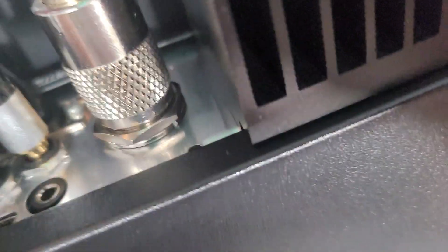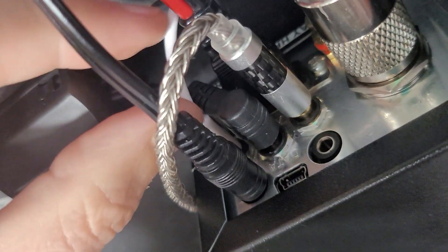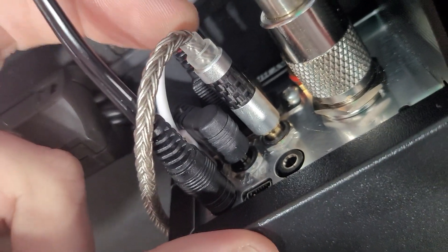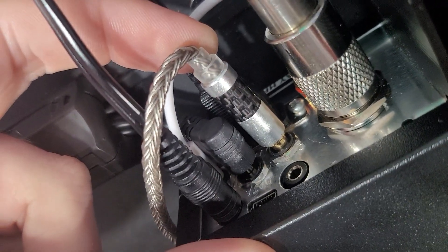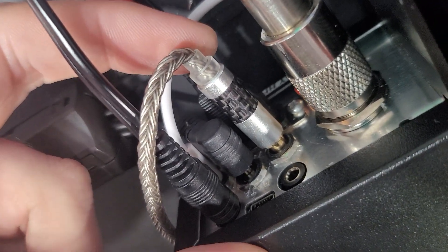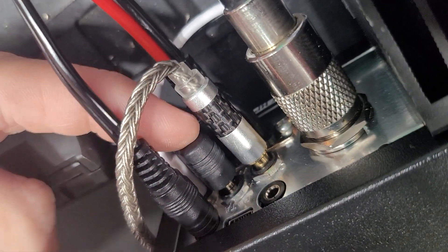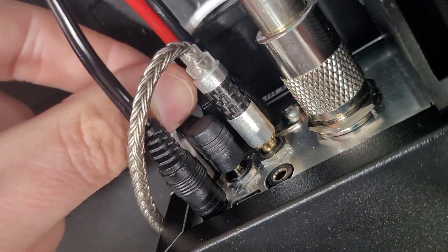Back adjustments here — you can't see the labels because I've got it covered up in wiring right now. But I did label it: you've got a relay for your keyer, headphone jack, MP3, and monitor. So three jacks that we added are right here — white plug, black plug, and this silver one. The headphone jack is going to be stereo, it swaps with the relay, and works with the monitor and all that. Or without it, if you didn't want to use the monitor. The middle jack is the MP3 with line level recording, and the end jack is the monitor.